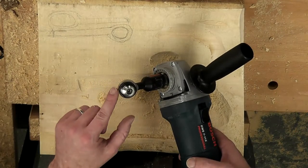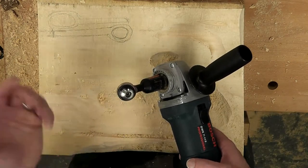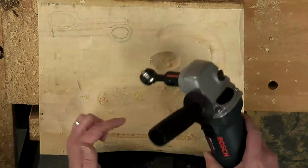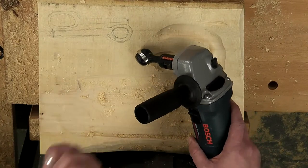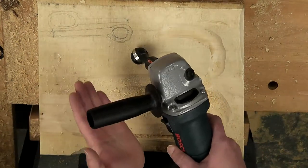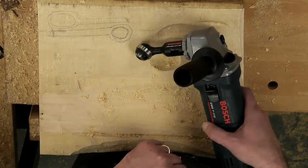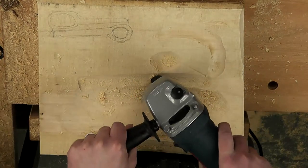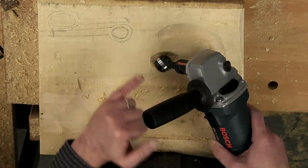It is flat, and the way it works is almost like a bowl gouge. It's got a bevel on it, which needs to be in contact. You need that bevel rubbing like we do in wood turning. So the way we present it, it's almost flat onto the workpiece, but because the blade is at an angle, it presents that cutting edge. But yeah, this won't cut straight down. So you can't bore down with this one. It needs to just kick over at an edge on an angle and have that bevel rubbing.